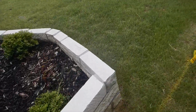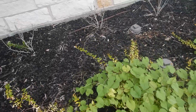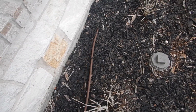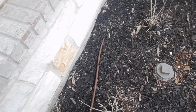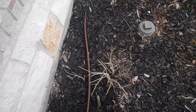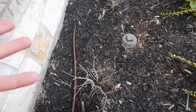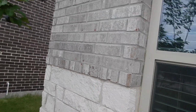Now, lawn sprinkler drip lines, this piping, it's allowed to be exposed, but it causes it to be susceptible to evaporation when it's exposed like that. And if it is exposed, you should have a staple every 12 inches to keep people from tripping on it. I've lost a couple bushes here. And that might be under your warranty. It's beyond the scope of my inspection, but it might be part of your warranty.